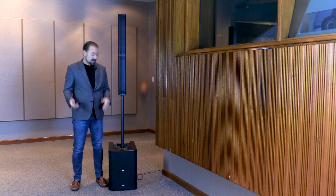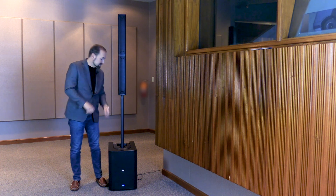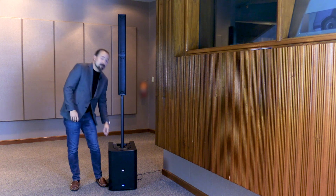After you're done with that, there's a couple ways you can check whether everything's working and the levels are right. The easiest thing to do is probably grab your phone if it's a Bluetooth streaming device and connect it to the Bluetooth channel. Simply go down here, select Bluetooth, press the on button, the little blue light will start blinking, and once it does, you can pair to the LN1263 by selecting LN1263. Turn the volume up on your streaming device, turn the level up on the channel, and the master level up, and you have music coming out and you're ready to go.